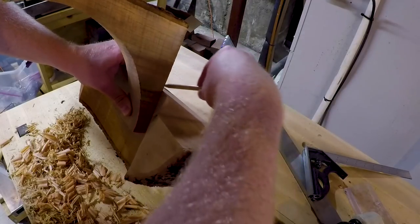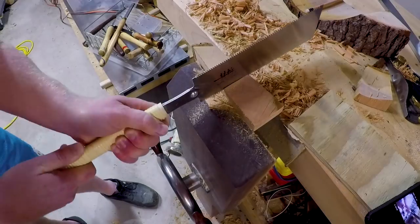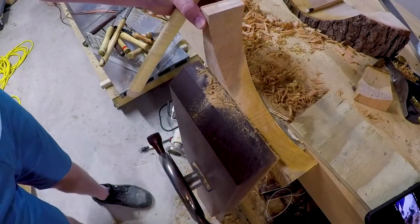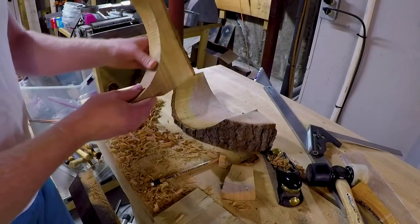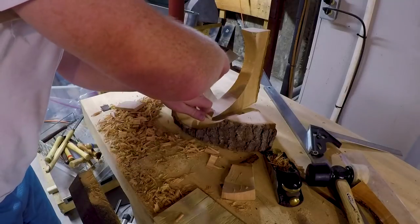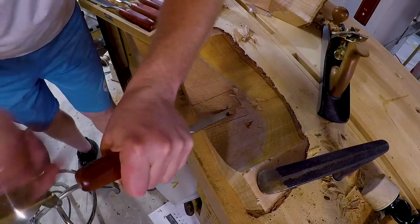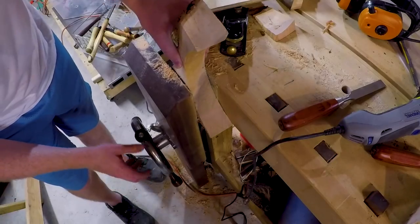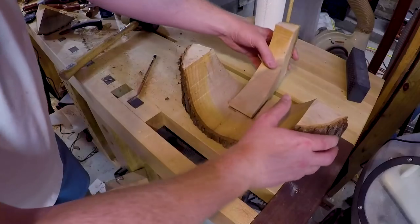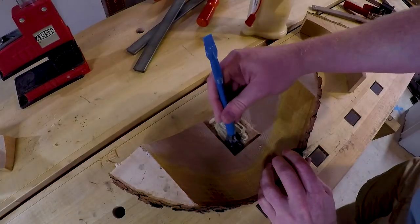The joinery was a fairly simple half lap. Cutting the mortise proved to be challenging, as it was all end grain. I ultimately was able to do it using a Dremel multi-tool. I did a dry fit, and then did the glue up with a couple of clamps.